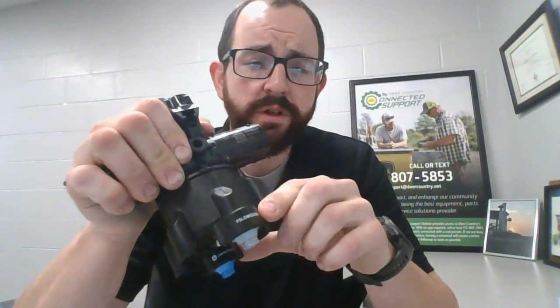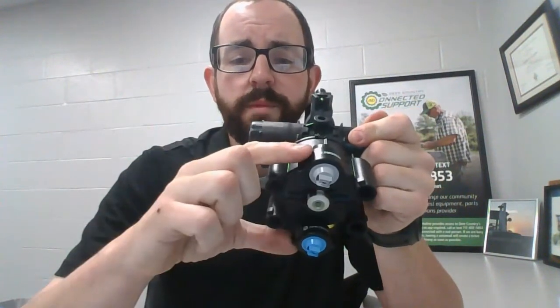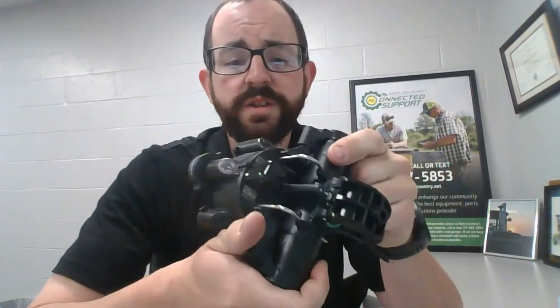In any other configuration where you have one, two, or three in the front, the smaller nozzle should always be in the front, or you can run the same nozzle and run them combined. It's always going to spray either A, B, or A and B combined, coming out of both nozzles. I hope that clarifies the common questions I get about ExactApply nozzle bodies and how you need to configure them — both virtually on the screen and physically on the boom.